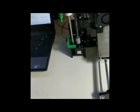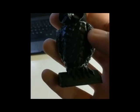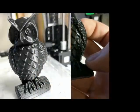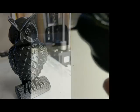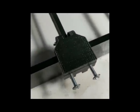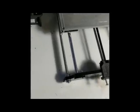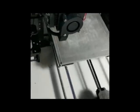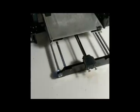After that, I decided to print off a test print and this is the quality I got — I'll put some pictures in here. The ringing is still there but it's almost not noticeable at all. It went from that to this. You see those little vertical lines? That's what I'm referring to — it's almost non-existent now. The only thing left to do that might make it better is putting an anti-Z-axis backlash on these lead screws, but I don't even think it's necessary. I'm rather impressed.